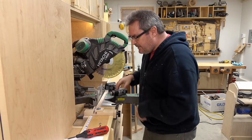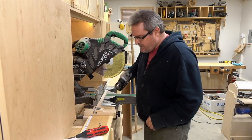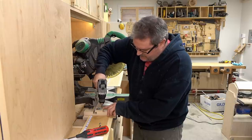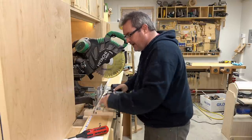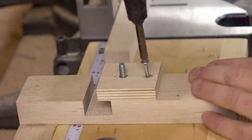Same thing for the one that holds the stick in on the top. I've used half-inch plywood this time. I've already drilled the hole and clamped it on with a wing nut. I'm going to drill through right now, and then I can take it off again and enlarge that hole and drive the screw that will hold it loosely in place.